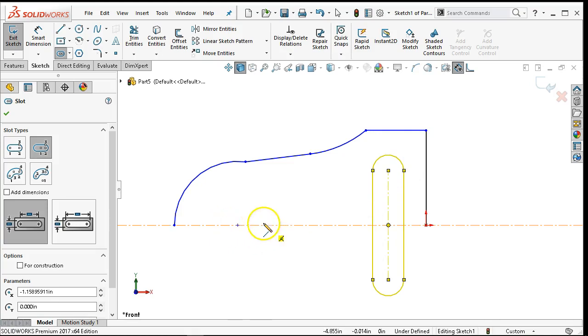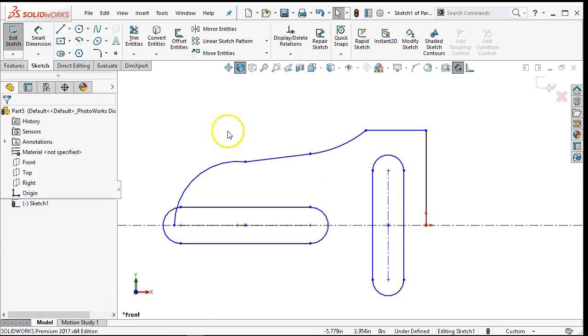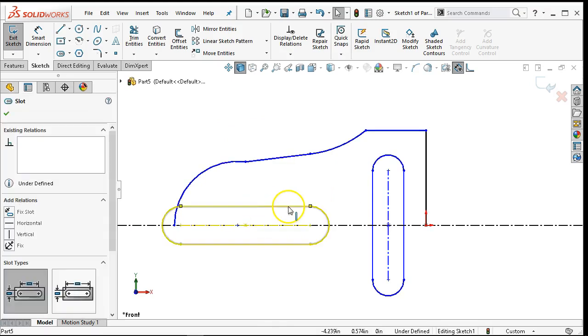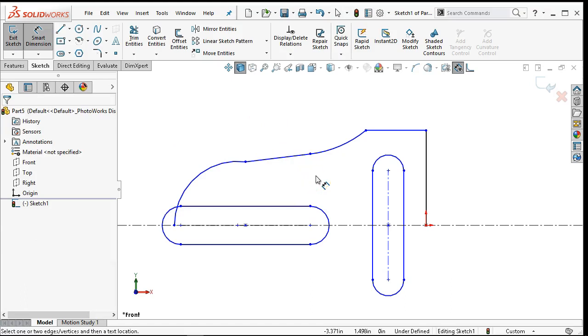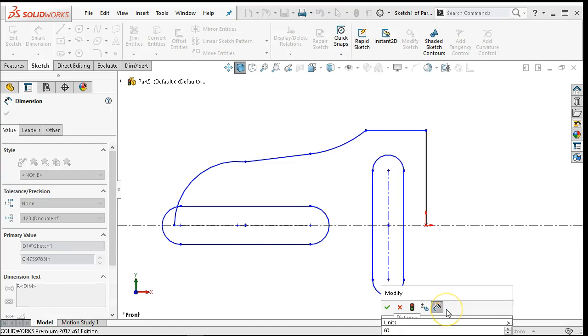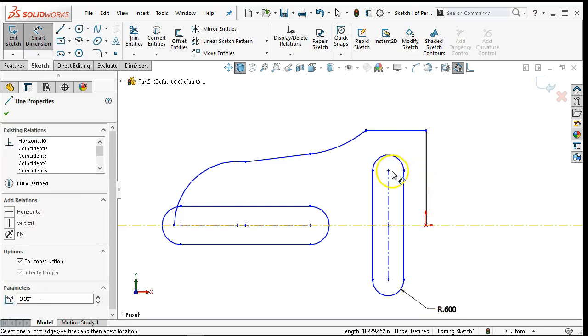And then, not sure where that one's lining, but it's kind of the same issue once you put one center line on top of another. Main difference here is that I can drag or I can dimension the whole slot. And we had a radius of 60, so I guess I better put something usable here. Oh, sorry, radius of 0.6. All right, that makes better sense. I'm still thinking metric all of a sudden, so 0.6. And 1.25 to the center.